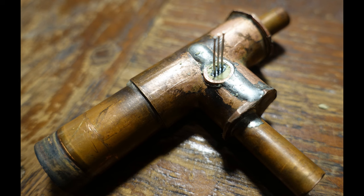When assembling small components like this, I tend not to use copper pipe fittings, partly because they are expensive and partly because they take up quite a lot of space. Instead I use copper pipe that has been cut down the side and flattened out to form a sheet, then cut discs out of that copper. Alternatively, if working with a pipe diameter that fits readily available copper coins, I use one. The United Kingdom Mint is particularly thoughtful about this because their one penny coin fits perfectly inside 22mm copper pipe and their two penny coin fits 28mm copper pipe.